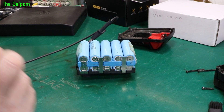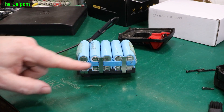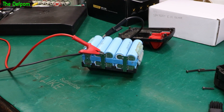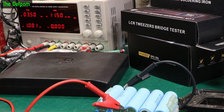I'm going to try recharging it and see what happens. I've set my power supply to 3.3 volts - still higher than this cell. I've clipped onto the negative junction into that one and the positive junction into that one, with a current limit of one amp. Turning the power on - it's doing 700 milliamps and dropping to 600. Let's increase the voltage a little bit to 3.5 volts. It's going across two cells so it's like 0.3C. I'll get my thermal camera out and check for any hot spots.